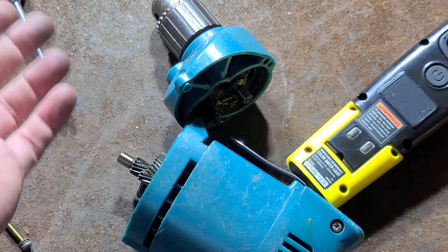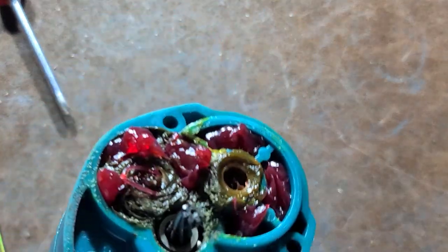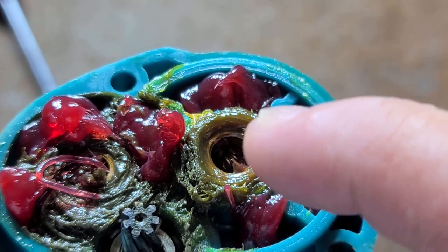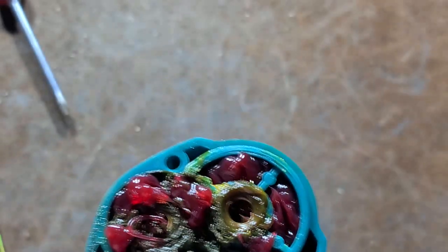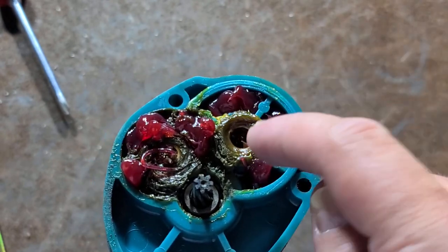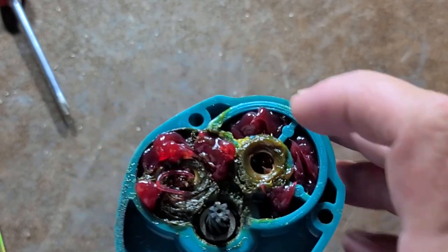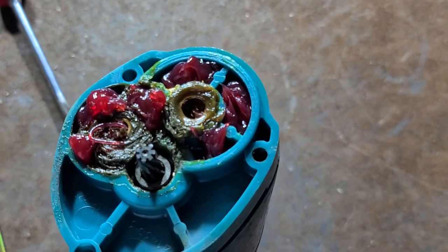I'll put a little bit of extra lube in here and then give it a run. Put a little bit of grease in there. You can put a touch of grease down in the bores, but just a little bit — if you fill up the bores where the sleeve bearings are, you'll have a hard time assembling it because there's almost no space for the grease to get out in the tolerance between the bearing and the journal.